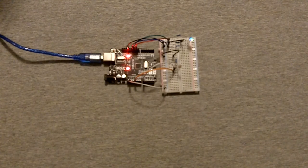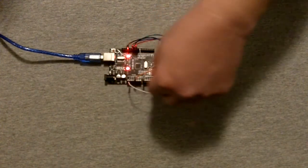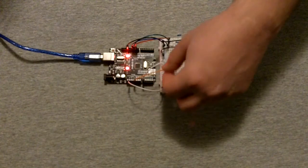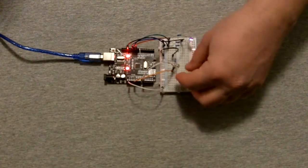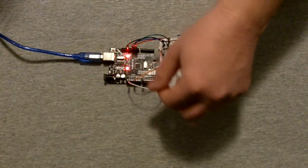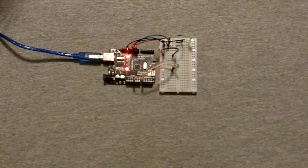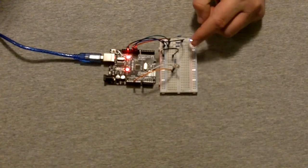But anyway, that will conclude the lesson for today. There wasn't a lot to do as far as the wiring was concerned. It was the 5 volt to the photosensor, and then the white coming out to the analog input here. We still haven't tied this back in yet as far as the lesson is concerned. This was just the 5 volt lead going to this common rail that I could use for testing the LED.